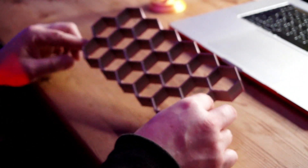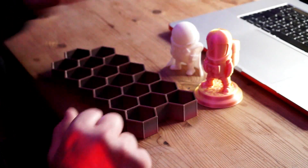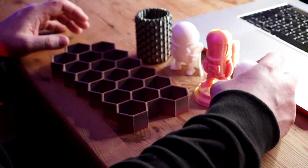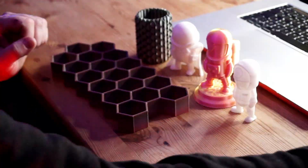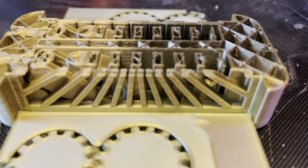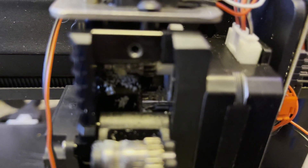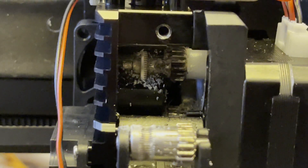There have been a few things I've been printing over the past few days. I did have a number of small problems with the Cura profile that came on the SD card and is downloadable on their website. Those problems are things like temperature control — when the print starts, it starts at maybe 200, then drops to about 180 and fluctuates. That causes a little bit of heat creep inside the nozzle. So I did have a blockage. I was printing the Torture Toaster on the Magician X, which puts a lot of pressure on any printer due to the complexity of the print. I believe the issue was actually down to the provided Cura profile having a rapid drop in temperature, so leveling that out should sort the problem.